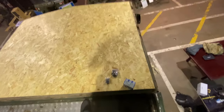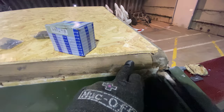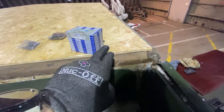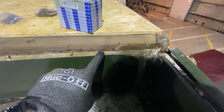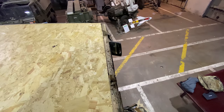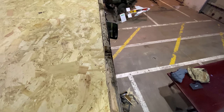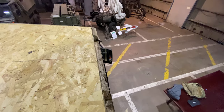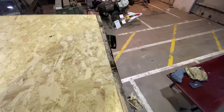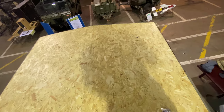One thing to point out is that if you come along you'll see this isn't quite lined up. It does fit inside; however, even though I've pulled out nails and screws and ground it down with a grinder — catching fire several times on this roof — there are still screws and nails I can't get out. Along the side this was the rotten piece. What I had my carpenter friend do is he came over one night and chiseled out all the rotten pieces, bar one or two spots we're going to treat, and made it so we can insert one piece along here with angled edges to nail it in, and then that job is done.